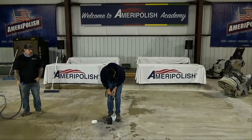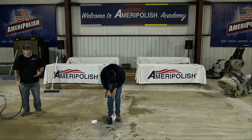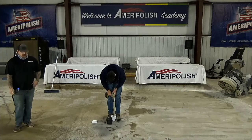Nice. When it comes to best practice, I try to put it down at the end of the day, go home, and come back within the 12 hours. The longer you can let it sit, the better it's going to be. Just like our densifier.